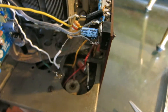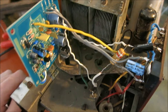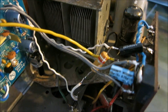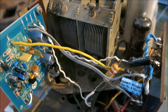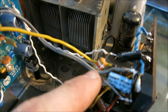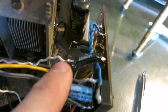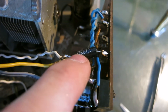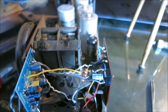It's not tidy, I know, but it works. So: speaker-minus, as before, goes straight to ground. Between speaker-minus and speaker-plus we've got a resistor, and the sound signal is now fed through a 22 nF capacitor into the amplifier section of the radio.